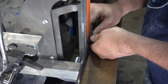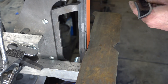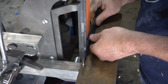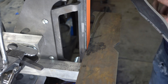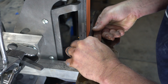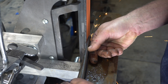This part — the free grinding of the bevel — is definitely the hardest part and takes the most practice. That's what everyone wants to be able to do. There's no excuse, you just have to put in the time and practice. This is just the initial bevel before heat treat, so I'll usually keep it between a quarter and a half inch from where I want it to be. I'll do the rest as part of the final grind after the heat treat.